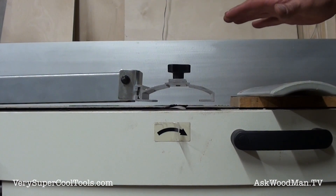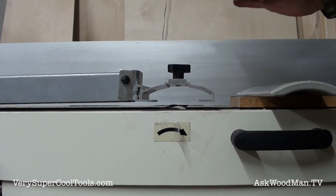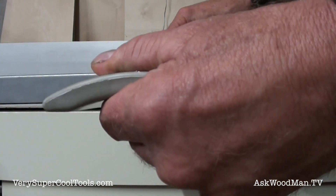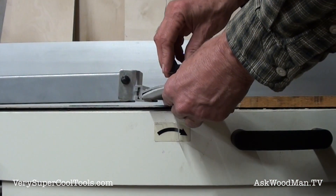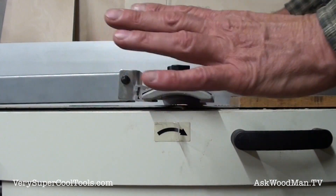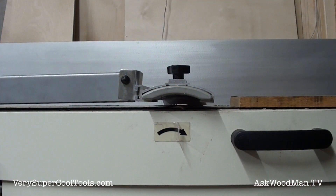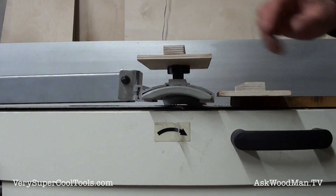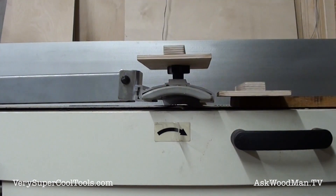It is just too dangerous a machine. If your fingers or any body part touch the cutting barrel, you're not going to get anything back to have someone sew on. It's an essential part of a joiner to have the blade covered at all times when you're working — it's just not an option to have an exposed cutting barrel. And this is a real simple solution right here to make it more convenient to pass around the joiner and just give you more safety options when you're working on it.